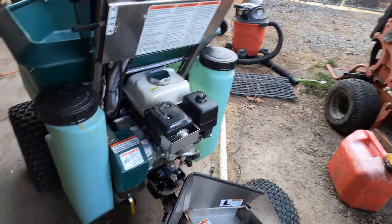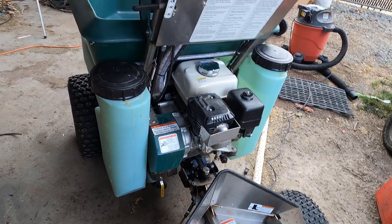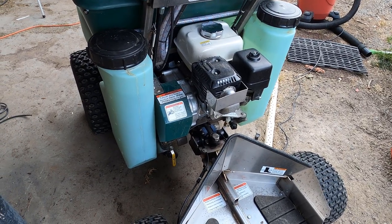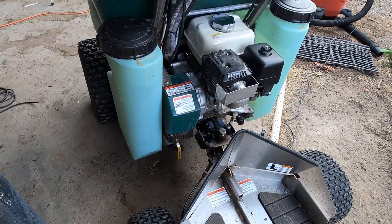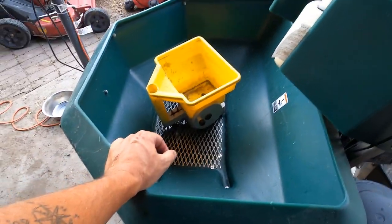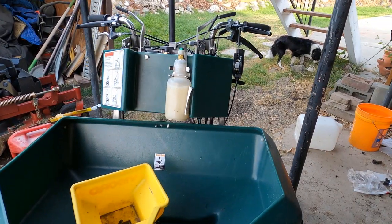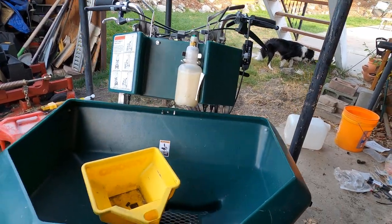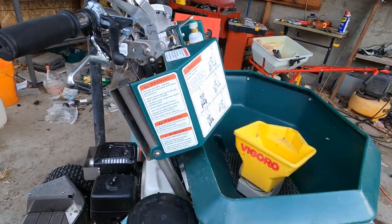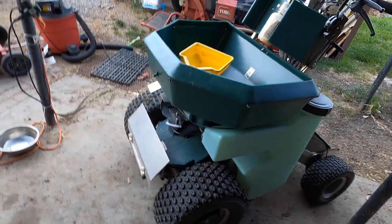There you go guys — it's really a pretty simple machine. I only have 5.3 hours on it, so I haven't even broken it in yet. At 10 hours is when I'll change all the fluids, engine, clutch, adjust the brakes, and whatever else is in there. I always throw a hand spreader in here too — if I'm in a really tight area I can just scoop and hit a tight spot. I also carry mesotrione; I don't like to blanket spray meso so I keep it handy. I've got some footage of doing applications when I first got it, and we'll use that for the action video. Thanks for watching.